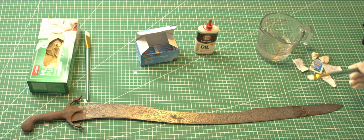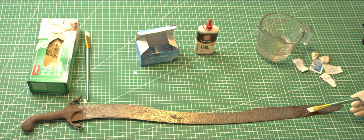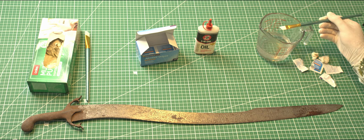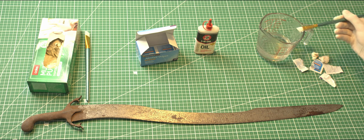As we're applying this, you're going to notice that I'm going to be going over the same areas a couple of times. That's because I'm trying to get a sufficient thickness, and that helps us in a couple of different ways. The thinner the solution is, the less active ingredient we get. And the thicker it is, the more gel is sitting above it, so the better inhibition we get of outside oxygen. That's rather important — we want to be converting the rust away and not allowing a liquid medium for dissolved oxygen to reach the steel and promote further rusting.